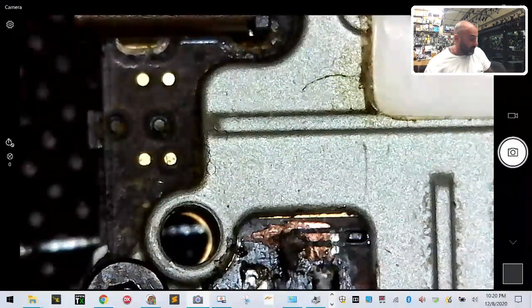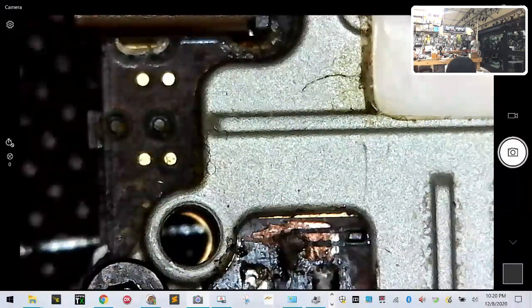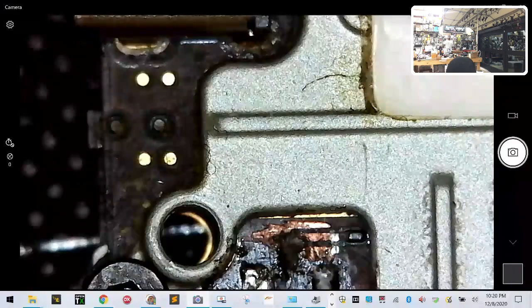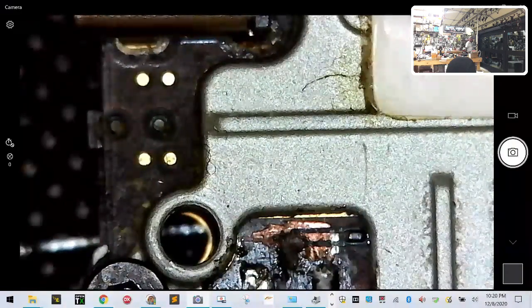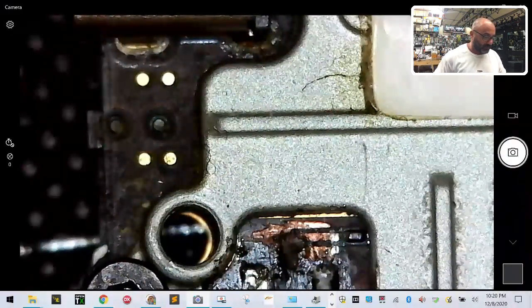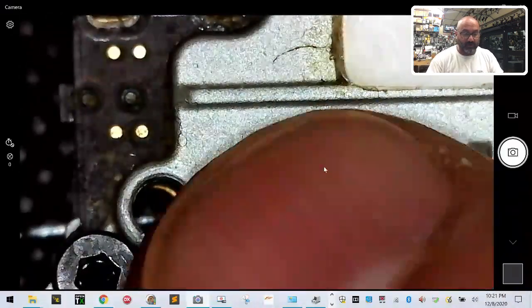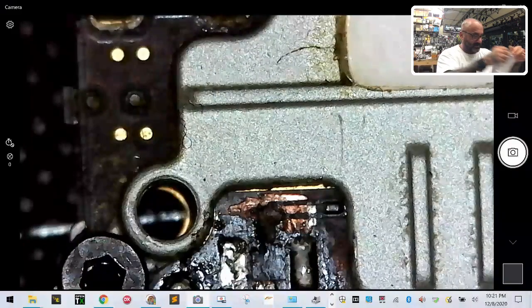To do that, we're going to have to get a UFL connector. And we're going to have to solder directly to the spot. So I'm going to go grab one real quick, okay? The thing that we're going to have to do is prepare. So let me turn the soldering iron on, and it's going to get super hot because the difficulty here is to make the connection quick enough. It's not an easy connection to make, right? And you will start eating away at whatever remaining things you have here. So let me go ahead and open the UFL. I have a bunch of them here.